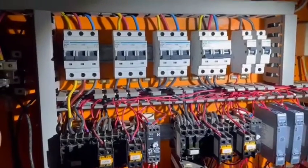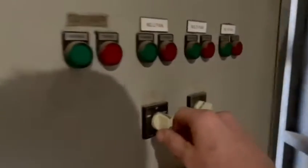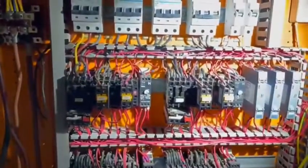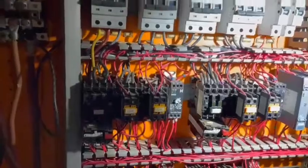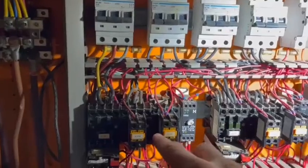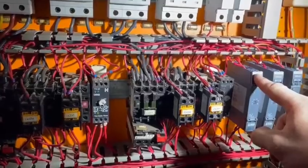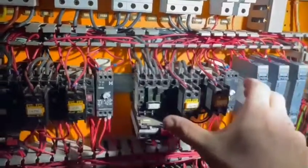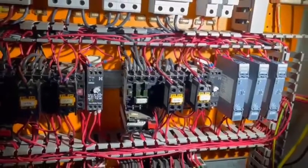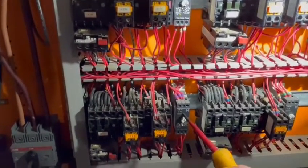The supplies coming in are off so the motors these are controlling won't run. I'm just going to switch the board over to manual — simply by operating this switch. What you'll see is immediately as you turn it on, this contactor will engage, and once it engages it livens up the coil on this time switch, which controls this one. Once this one engages it should bring the next one on.